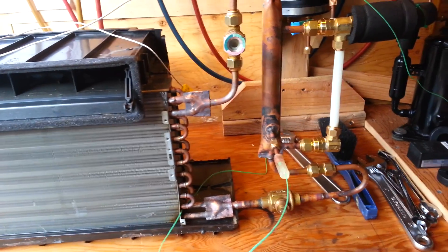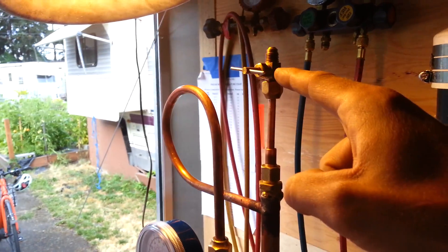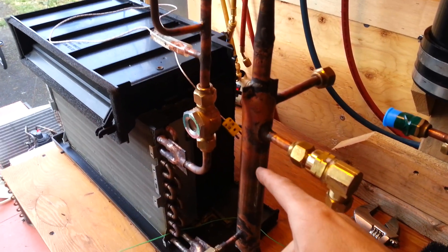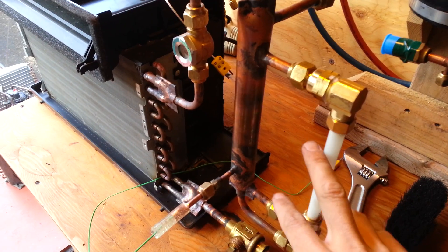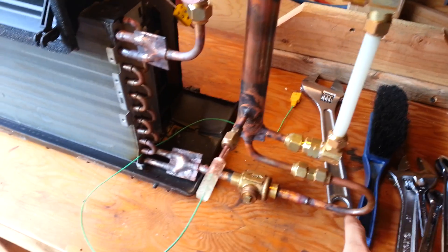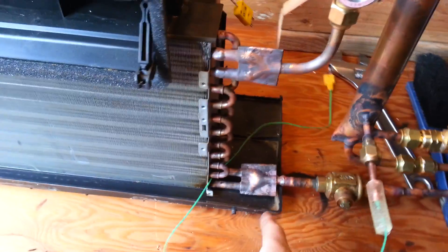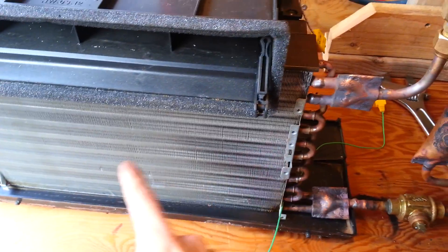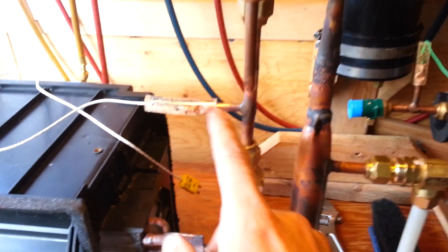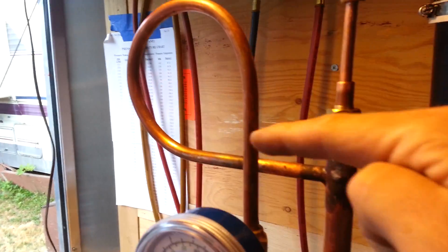Not exactly sure how it's going to operate, but some main components here are a brass needle valve, an ejector assembly, a gas-liquid separator, and a sight glass. Liquid comes off, goes through a gate valve which can be closed down to act as a sort of throttle. Liquid refrigerant is fed to the coils, and a gas and possibly liquid combination come up through the sight glass, temperature sensor, pressure sensor, and then back into the ejector.